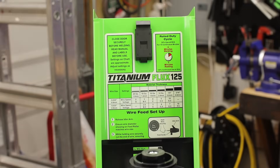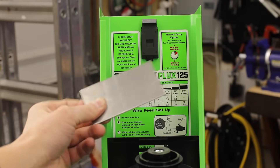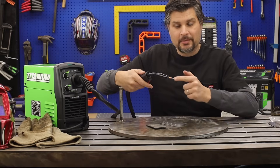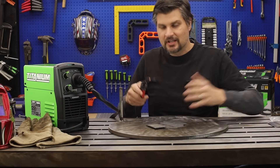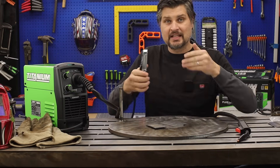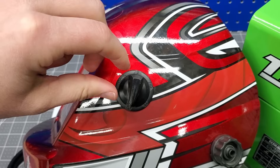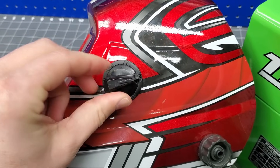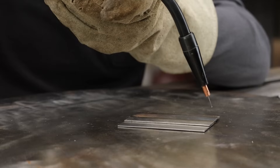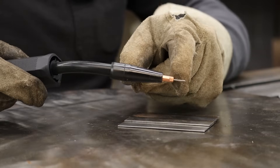This is a two-scale gauge — if you aren't sure how thick your material is, put it up there. It's hard to get anything other than a coupon up there, but it gets you in the ballpark. If you pull the trigger and the wire is coming out but you're getting nothing, the number one thing to check is that your ground clamp is connected either to the metal table or directly to the workpiece. This isn't too high of amperage, so I'm going to turn the shade on my welding helmet to about 10. I'll be going straight down and dragging this entire weld, keeping the stick-out about half an inch — that is the amount of wire sticking out from the contact tip.